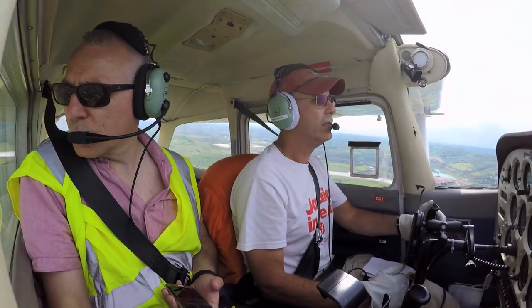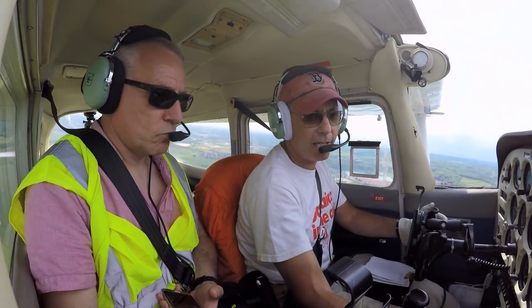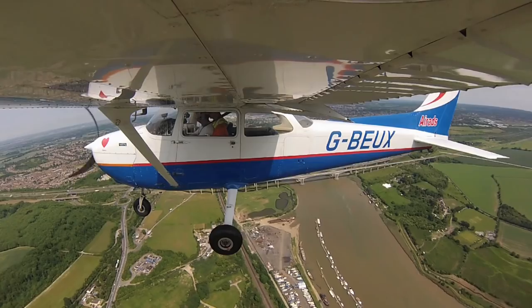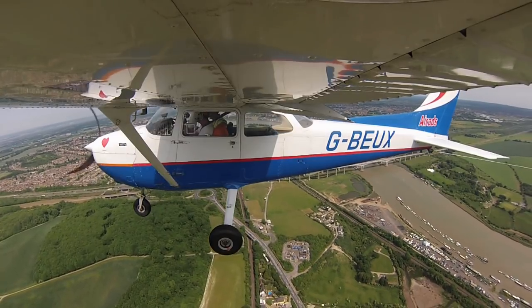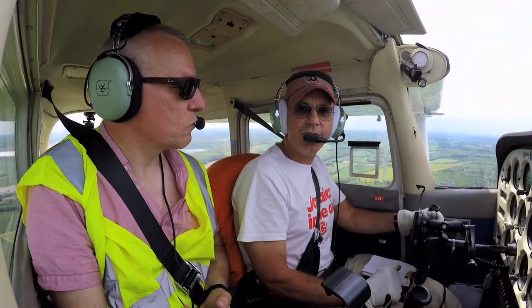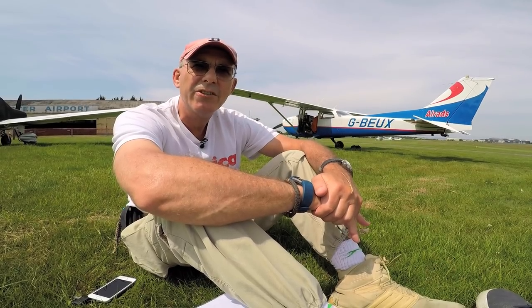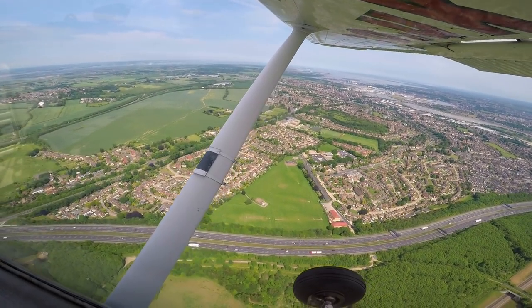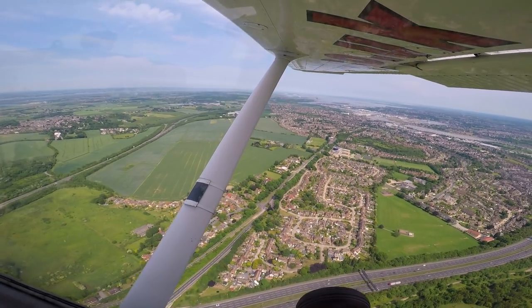Obviously you're on board so performance is dropping a bit with the full load as well. I want to get up to my thousand feet across the Thames. 70 is good, T's and P's are good. Landing light off, everything's up, flaps are down — temperatures are good. Here comes a thousand feet, and now we're going to loiter. You fly with the flaps down for another reason: obviously because we're at a slow speed, and also for the deck angle for cooling. As long as I'm on the speed and not going over 70 — I don't want to trash the banner. Things can go wrong in banner towing because you're dealing very close to the stall, flying very close to the ground with a large washing line behind the aircraft creating a huge amount of drag. Simon says stalling the aircraft after the pickup is a mistake novices will make. There's also a risk of getting the line wrapped around the elevator — there are procedures for dealing with this emergency.